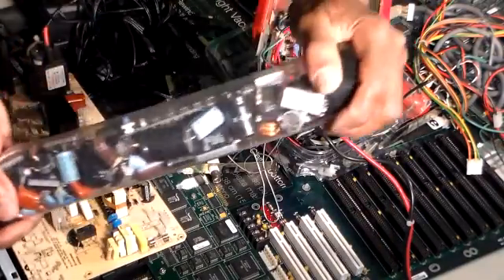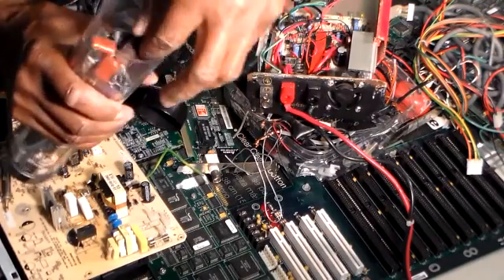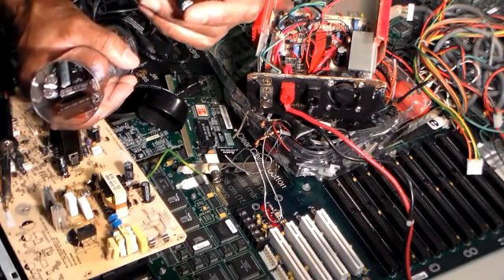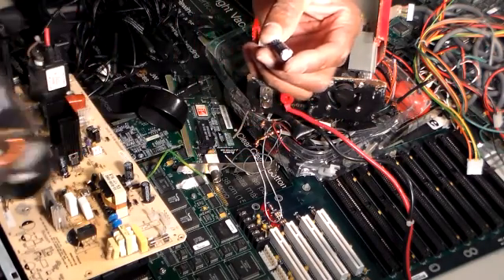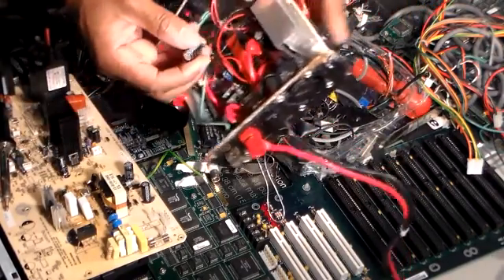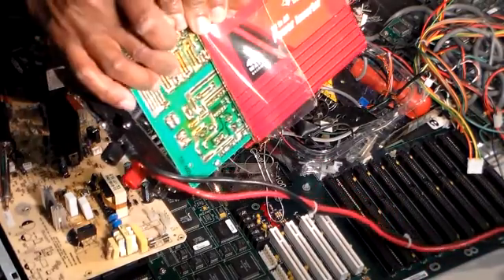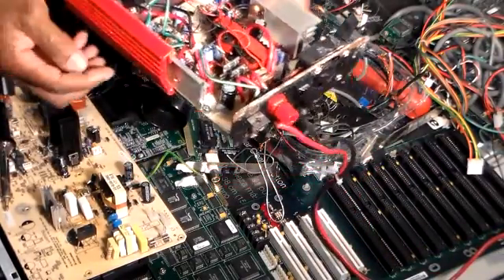This is my storage. I saved my capacitors as I went through here, pulled them out, and I found one that was pretty close to what was burnt out. I just inserted it into the circuit board and re-soldered the component with my solder gun, turned it on, and it works fine — it came back on.